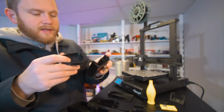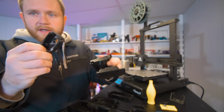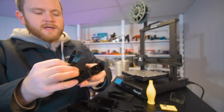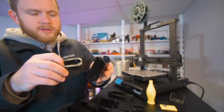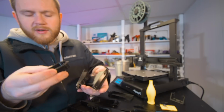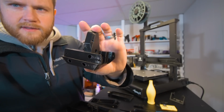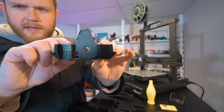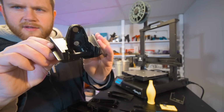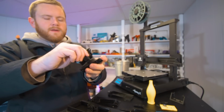And the reason why you do that little calibration is because this is printed 2 different days on 2 different machines. And as long as you get that calibration correct, you can use horizontal expansion, for example, to make the holes a little bit bigger, a little bit smaller. All of this should fit right in. Let's hear this. Bam, look at that. Perfect fitment. 2 different machines, 2 different parts that have to fit with each other.